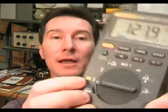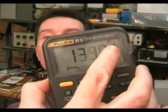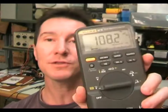It's also got the usual functions these days. It measures capacitance to plus or minus 1% accuracy, which is pretty good for a cap meter. It measures frequency, but it only goes to 200 kHz, which isn't very high, so it's not a great frequency counter, but it's handy — it does duty cycle percentages too. There's another neat feature on the AC measurement range: it's got a low-pass filter function. You just press shift and it filters out high-frequency noise, which is really quite handy.